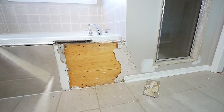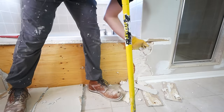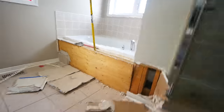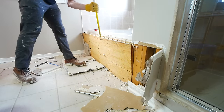For this demo process, you will see us using a three-foot pry bar a lot. Great tool for demo — has a lot of leverage and a lot of power behind it, as well as a hammer, and of course, you want some good protection on. For this, what we did is we started off by just removing all that tile, smashing it out, and using the leverage from the pry bar to get it off of the backer.